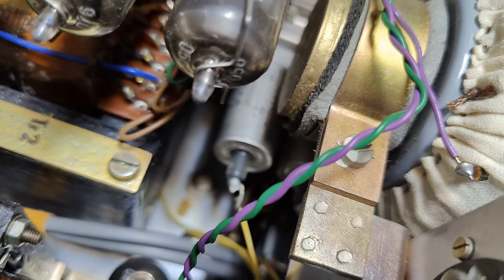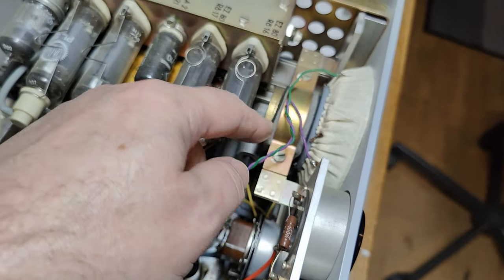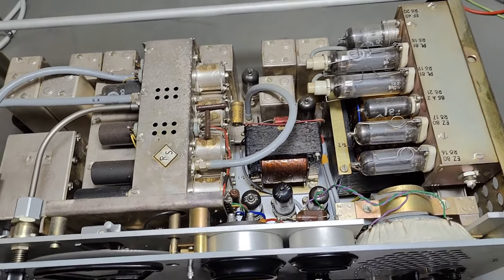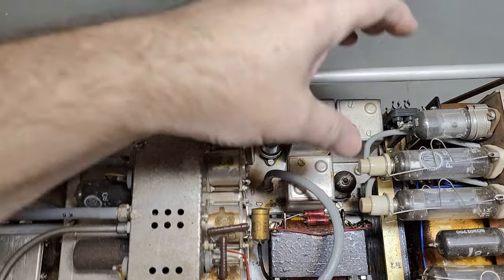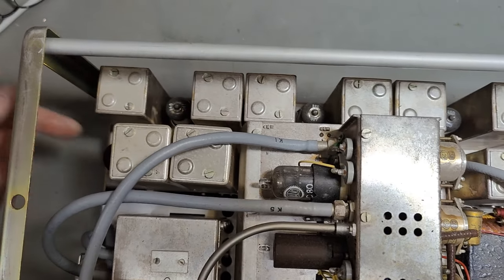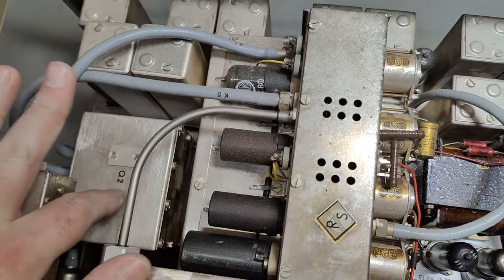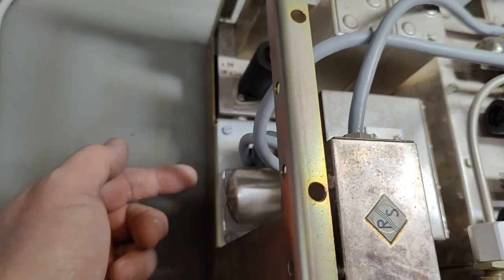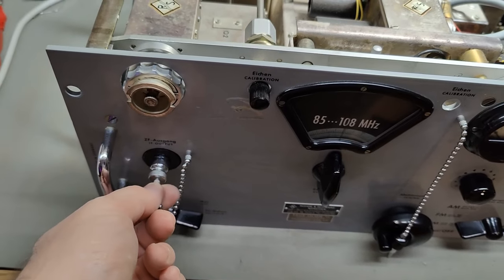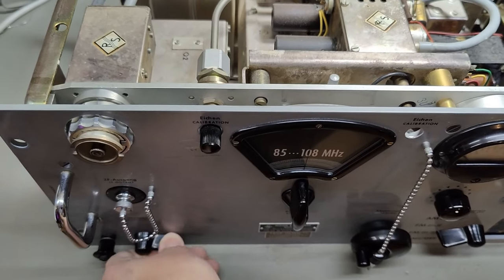Really nice - look at the glass. No expense spared. Loudspeaker mounting in little rubber. It's just beautifully made, really. And we got quite a lot of tubes all over the place. This long piece here at the back is of course IF. Got a lot of amplifier tubes along the signal path. And down here they call this Q2 - I believe this is the IF oscillator, and that tube is hidden in here, because that IF output and calibration goes into this unit.